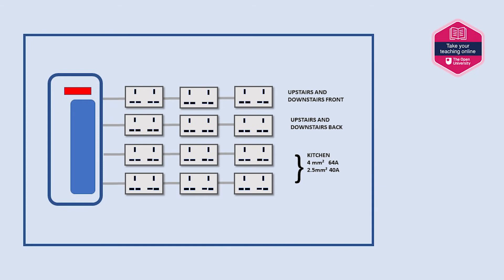This is an arrangement using radial circuits for the average home. The kitchen layout would cater for most situations with no requirements for dedicated circuits such as ovens and hobs. So the total number of circuits would be no greater than a couple of ring circuits.